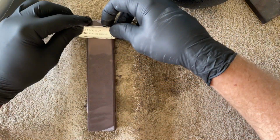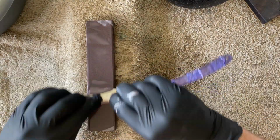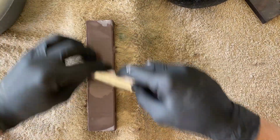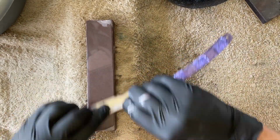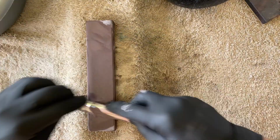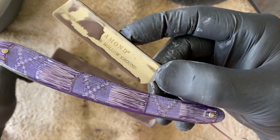And unlike the slurry that breaks down, these garnets actually do not. They fundamentally are very hard, very abrasive, and they just keep cutting. I'm quite sure they will break down and become smaller over time, but it can't be a lot. So from a light pink with all the swarf in, it's really turned to a dark purple.